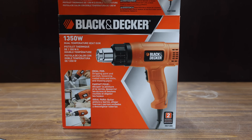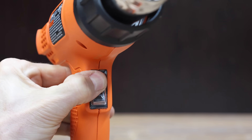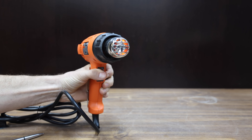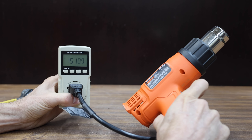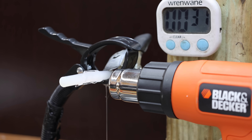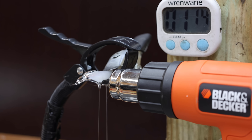At a price of $26 is this Black & Decker, 1,350 watts up to 1,000 degrees Fahrenheit, with two temperature settings, built-in stand, and three-position side handle. Made in China, it's the lightest yet at 0.97 pounds but the loudest yet at 80 decibels, delivering just over 1,500 watts. It begins melting the glue in less than 15 seconds, appears to move a lot more air compared to the Wynn, and finishes at 1 minute and 12 seconds to move into second place behind the Seek One.